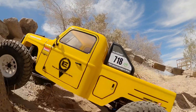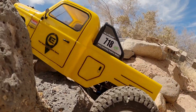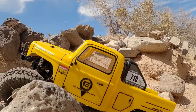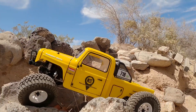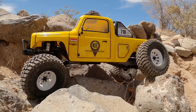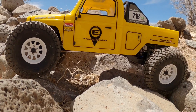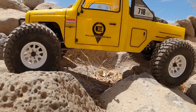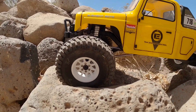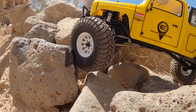This motor is not the fastest — it's walking pace at best for top speed. They offer it in an 1800kV as well, which is a little better for top end and is arguably their more popular option between the two in this model line. But for me, 1200kV is where it's at, because what I'm after is FOC technology on full display.